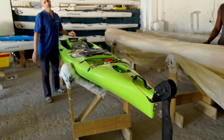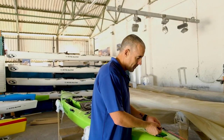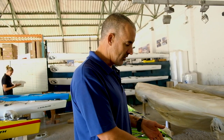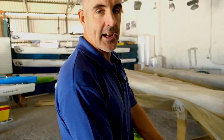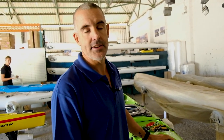That's the simple kick-up rudder system you can now install onto an existing Fusion using the mounting points on the back. The only difference with older Fusions is the T-bar was never put under a split ring, but that's something you can change. The kick-up rudder system is supplied with rope and a split ring — if you order it, you just slightly change the setup to remove the T-bar and you're done. To remove the kick-up rudder and reinstall the understern, it's just a reverse process — disconnect here, connect the split ring, put it on, and you have an understern rudder. You can have an overstern or understern rudder on the same kayak, no problem at all.